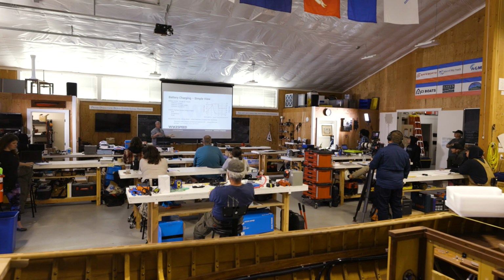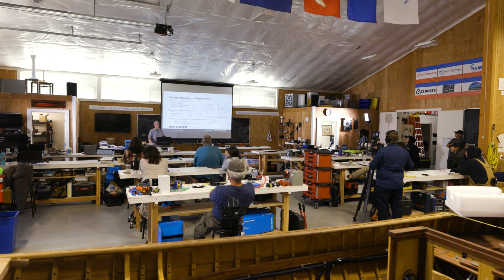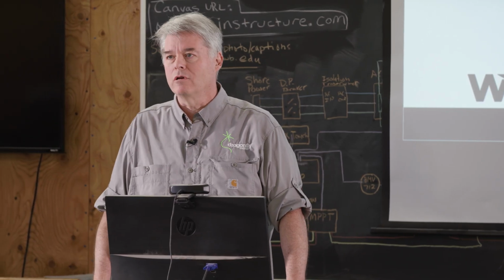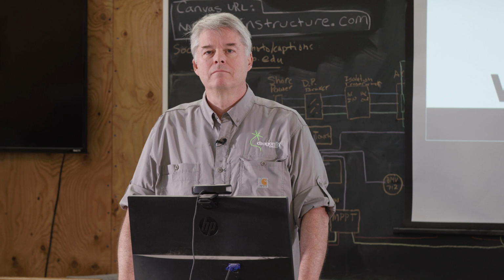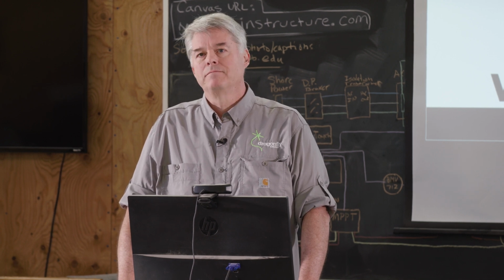So if I'm going to choose one of the two evils, I'm going to choose this one. I'm going to undercharge. And then when customers call and complain, just say, your batteries are 3 years old. What more do you want? And that was a prevailing wisdom in the marine industry. Your batteries are 3 years old. The guys that have been around long enough, you've all heard that. Bull pucky. 3 years old, your batteries died because they're not being charged properly.